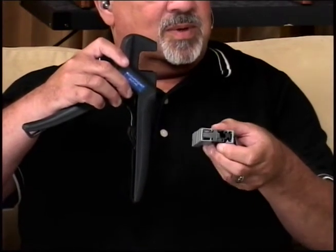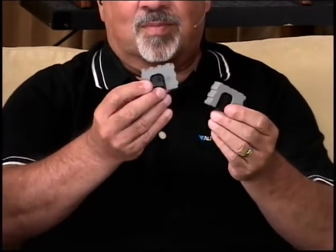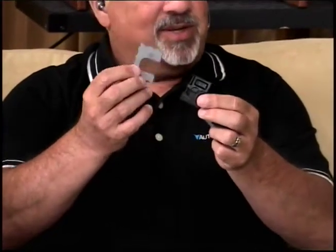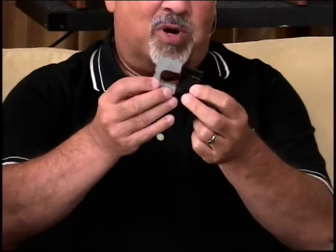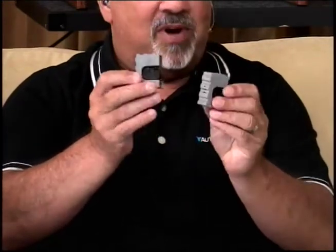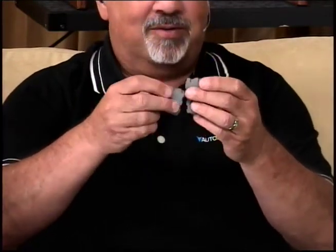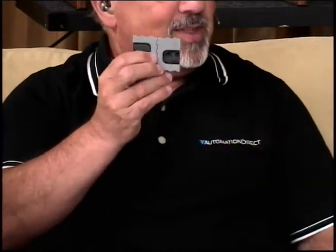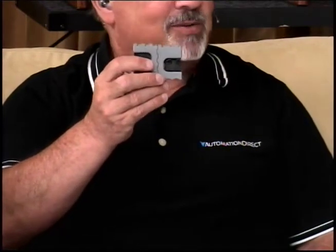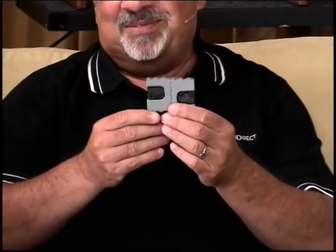And what Tom's got there in his hand, the gray piece is a little protective cover that you can keep them in. You can store the dies in it. Let me pull the die out. The crimper I had in my hand didn't have a die in it. And actually, what I'm holding here are the RJ12 and the RJ45 type crimps. These are neat because they're dovetailed, so they can stack up together. And I think I said earlier, if you get tired of the holders, give them to your small children to play with as building blocks. So they're adult Legos. Yeah, they stack together so you don't lose them.